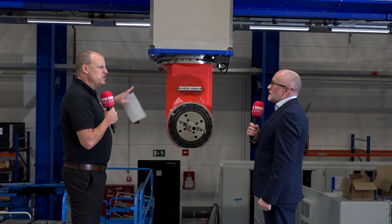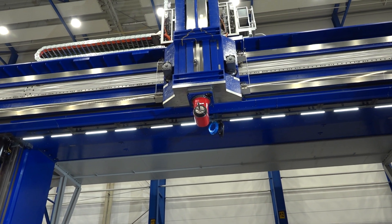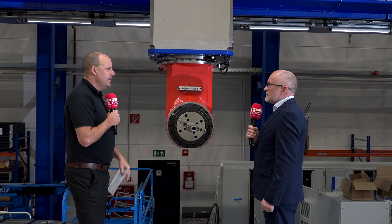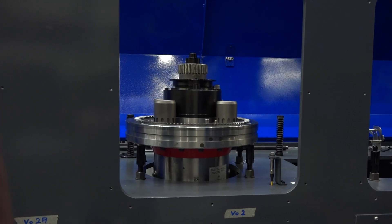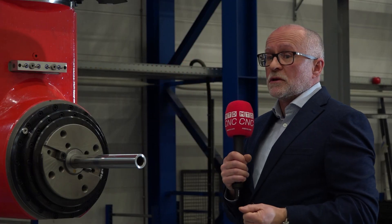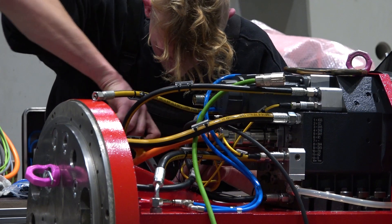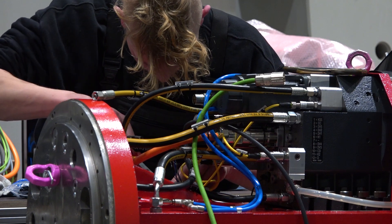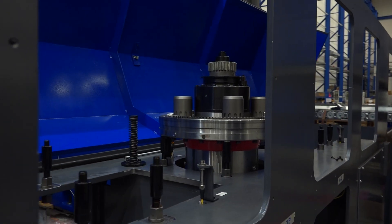This RAM is 650 square. When you're talking about these different areas of machining — how do you go from milling to turning to grinding? Just change the head? Well, you've got an interface in the head, along with a C-axis. You've also then got your media, your electrics, your coolants and your hydraulics, all fed into whatever system is required on the front of the RAM. All interchangeable, and then the tools are interchangeable onto the front of the attachment.